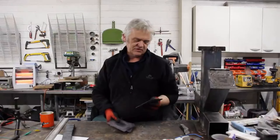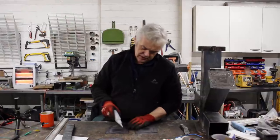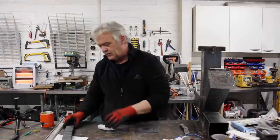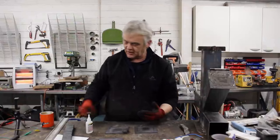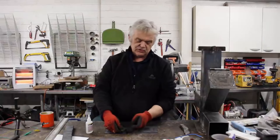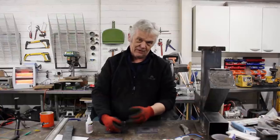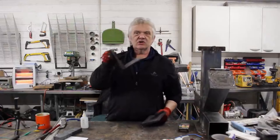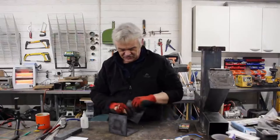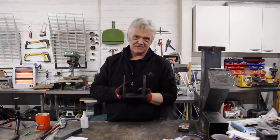We have our bunch of ceramic magnets — reclaimed or bought — and three steel plates. These plates are 125 mm square, 1 mm thick. A bit of super glue along the line on the steel plate, then with the north pole facing up, stick the magnets on the plate. On the opposite plate you want the other pole — unlike poles attract, like poles repel, so we want them attracting. Glue those down. Once the magnets are attached, attach another steel plate to the top of the magnets, and that is the magnetic field assembly of our MHD device.